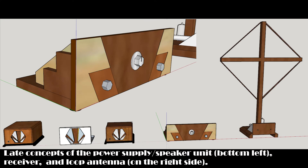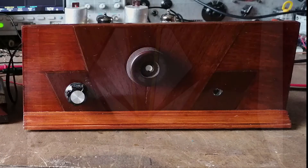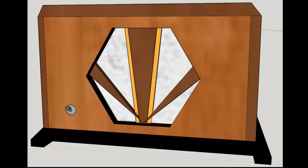The whole set was designed in art deco style. This radio is a very simple superhetrodyne receiver with no automatic gain control and only one band, that is long wave, which should cover from 150 kHz to 350 kHz. But my local oscillator has a much wider span, and the input network does not track the oscillator properly. So I have tuned the local oscillator and input filter in such a way that it produces the correct IF when the radio is receiving Polish Radio 1, that is the station at 225 kHz.